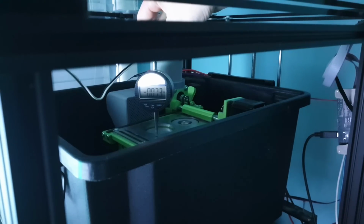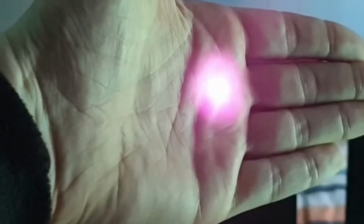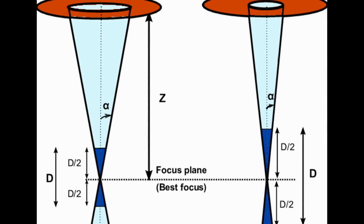You can see the lack of repeatability in each of the measurements I make, and any inconsistencies in the machine deck would only further contribute to misalignment. Because this laser source is highly divergent and requires a larger focal length to effectively collimate, and conversely when focused, the beam also has a sharper convergence, this means the depth of focus is much shorter, and any misalignment will have a greater impact on the ability to achieve peak power density.